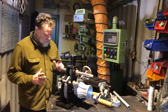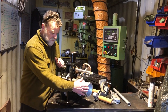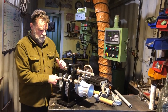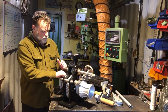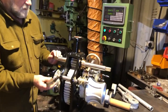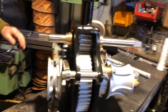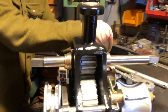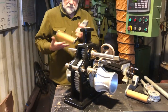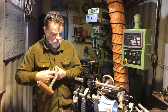It's a straightforward warping drum on this side, with a hand wheel operated brake and gypsy on this side over here. You've got the pull here which disengages like that, and then you've got the brake which is operated using the hand wheel. It comes with one of these crank handles as standard, with an S profile on it.